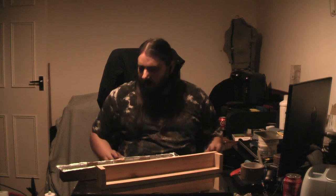It's always useful. So the plan is that I'm going to do the mirror first, do the flat sheet with the denim, and then any leftover resin will get mixed up with the denim scraps, and then we'll go in here. And then I will move on to doing the vertical stacks, and then any spare leftover resin from that before it goes off will go into this thing, and then it just saves wasting anything. So it's almost like getting a free fretboard, because we're using the scraps of the denim, we're using the scraps of the resin, no harm, no foul. So I think that'll do it for this one.